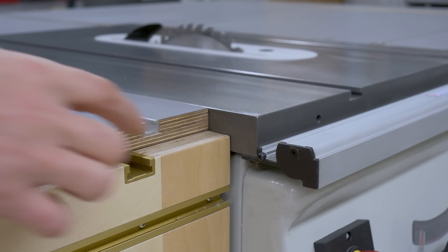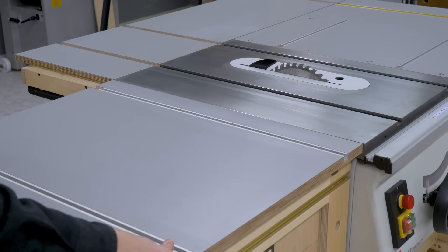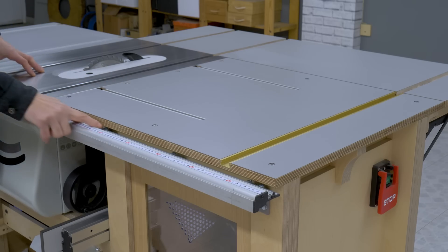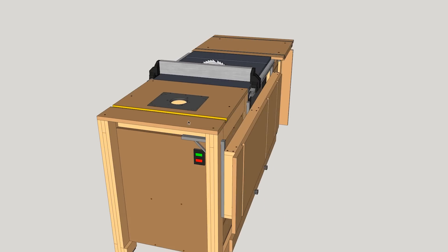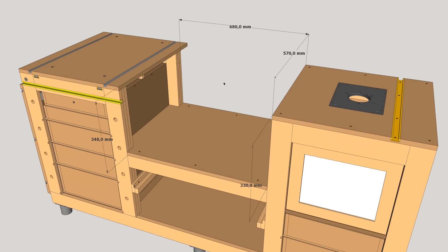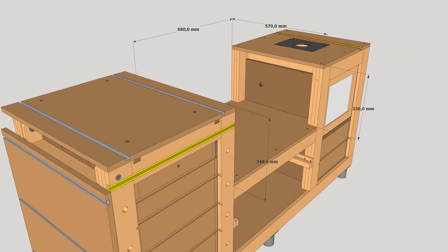The position of the adjustable legs of the new bench saw has been determined. The work table juts out about 25 mm in the front of the bench. I made the plywood tops a little deeper so that they're in line with the saw's work table. Since this saw is less wide than the DeWalt, I've had to make a bigger work table for the router. The good thing about this mobile workbench — designed for one of the biggest bench saws on the market — is that it will now be easier to adapt to almost any kind of bench saw, even one with a wheel to tilt the blade on the side. You can install any saw as long as it's not over 35 cm high and 68 cm wide.